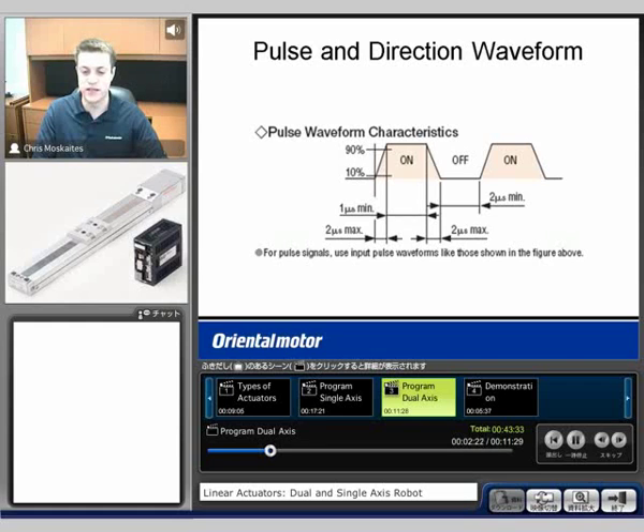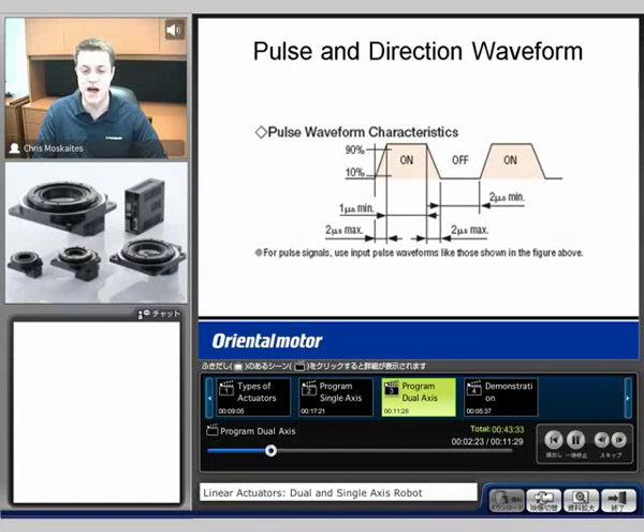We're typically looking for a zero to five volt type pulse — on and off quickly. We'll see the different on times, the acceleration of how fast the waves should get up and things like that. But for the most part, a zero to five volt pulse will make it move one pulse depending on what our resolution is set for. We'll input lots of pulses and the actuator will move a specific distance.